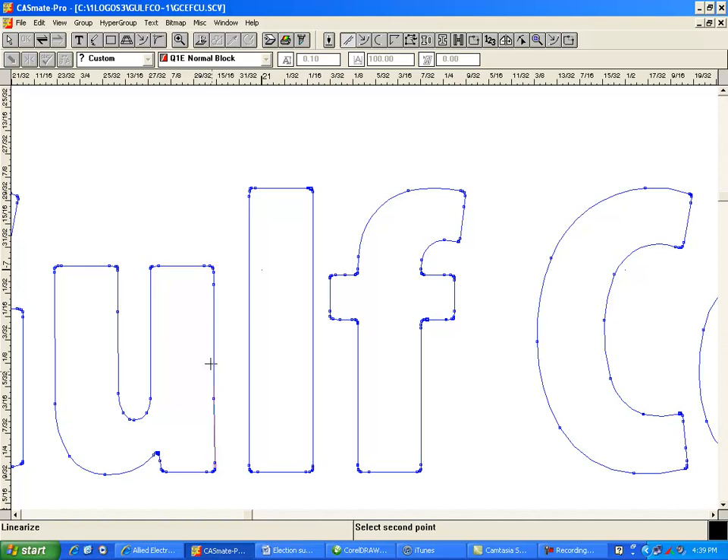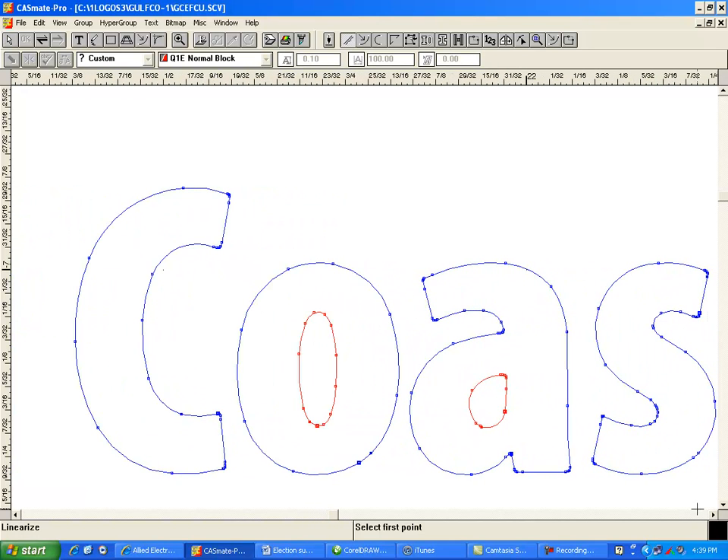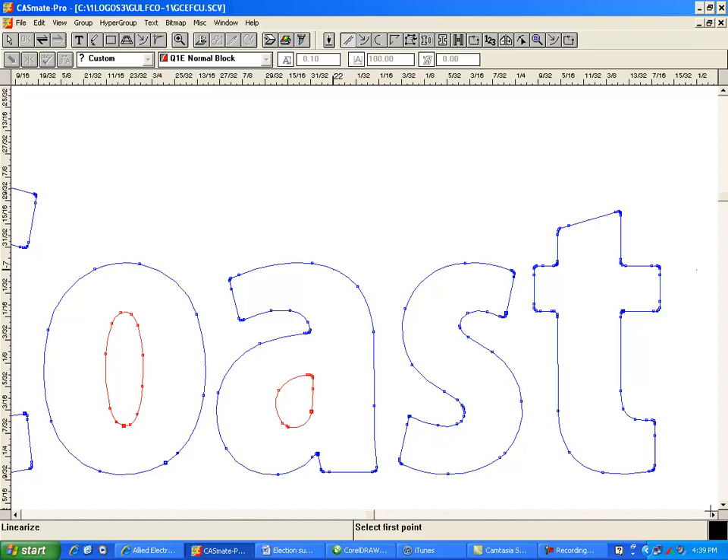I can also make straight corners if I wanted to. On this logo it really doesn't matter because we're going to be using a round tool. But anytime you see a lot of points somewhere, when you do a fill pattern those points will propagate into a lot of points. The fewer points there are, the less data in your software or logo, and it will engrave a little bit faster and be a smaller file size.